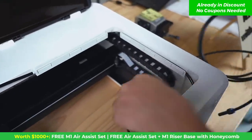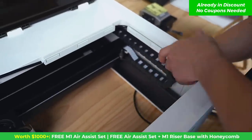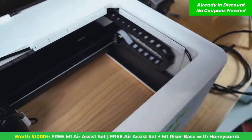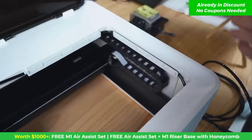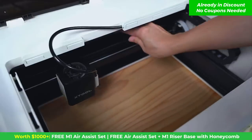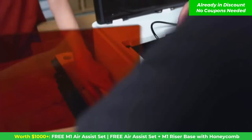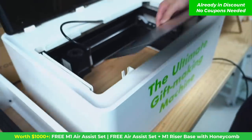There's a hole on the bottom plate for you to take the tube outside of the machine, because we need to put the pump outside of the machine. And yes, that's the way how to install the air assist. And so we can put the bottom plate back.